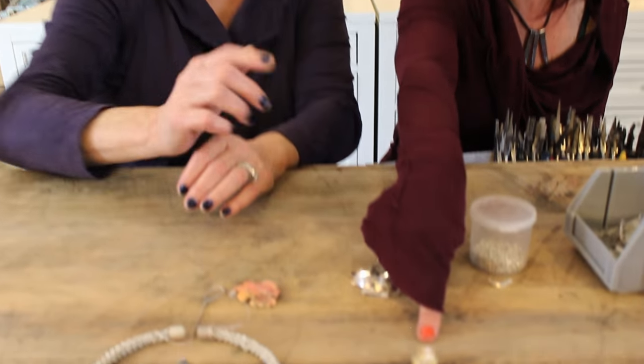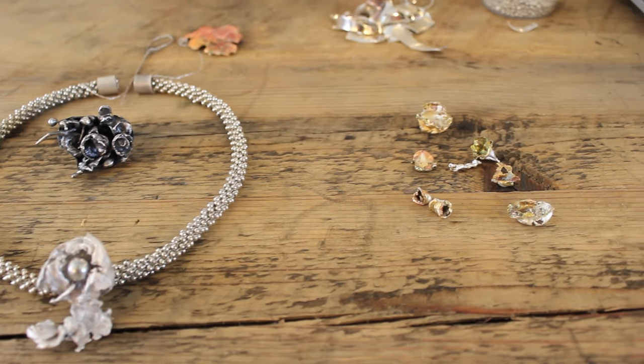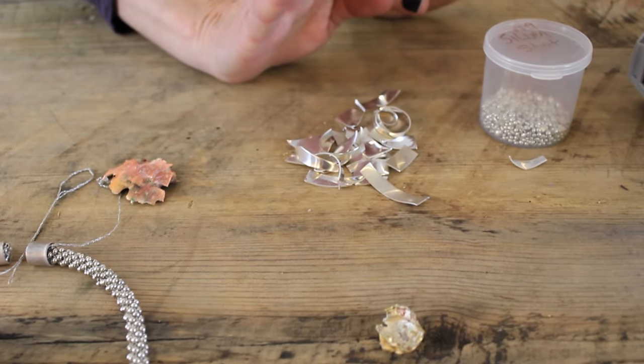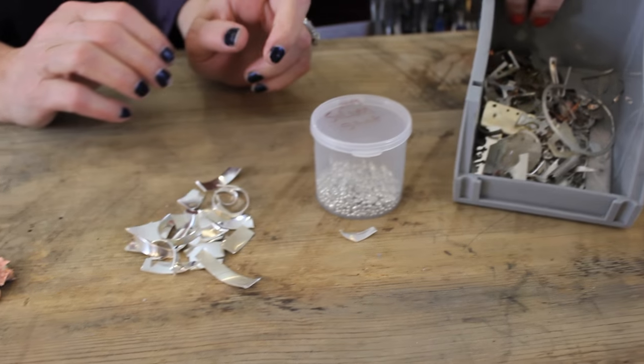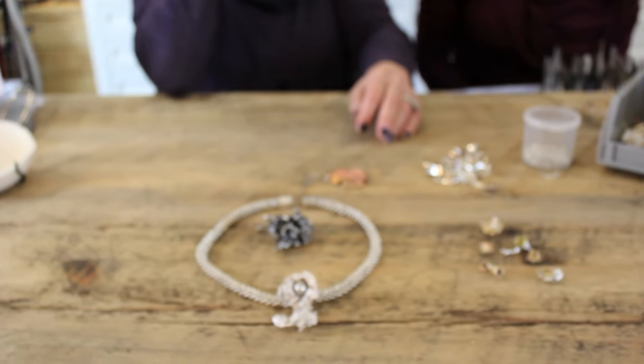So water casting is when you're just melting your metal — usually silver — and you just dump it into a bucket of water. You have no control, you have no idea what you're going to get, but it's really fun. It's kind of like Rorschach art — ink blot test — you pull it out of the water and see if you can see anything in it. Here are some examples of the stuff we've pulled off with water casting. You get a lot of these cuppy shapes. You'll need some kind of silver — fine or sterling — you can cut up some sheet, use silver shot, or scrap. These are some of the things you can make, and we're going to have pictures of Sugar's work at the end of the video.